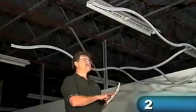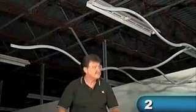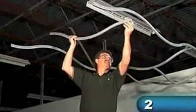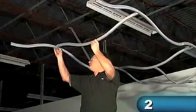Double-check the locations of any utility circles to be installed at intersections. For now, skip past these sections and install just the standard cross tees. Install the remaining 4-foot cross tees first, then the 2-foot cross tees.